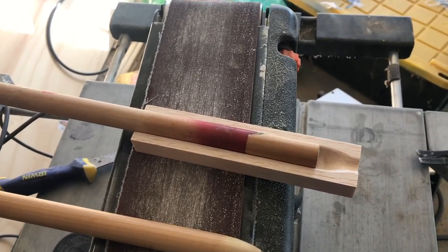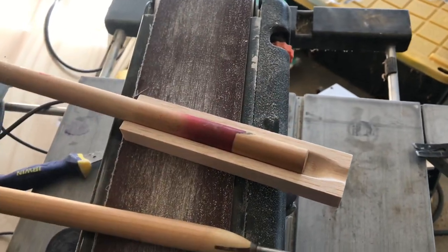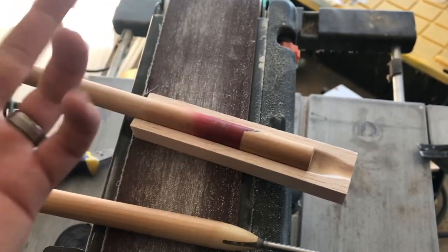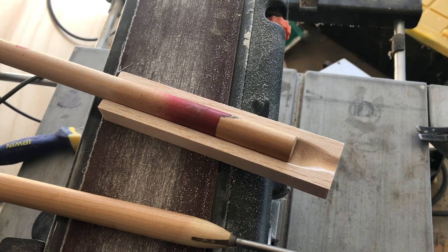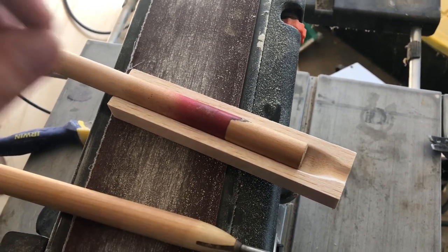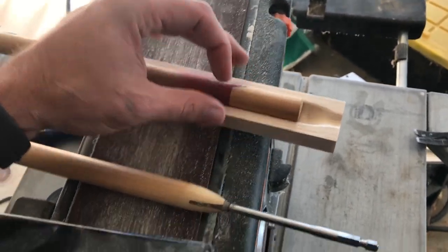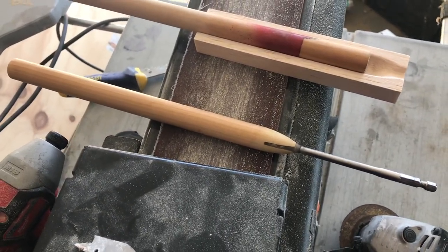I bought one dowel for the inside diameter and one for the nose diameter, drilled a center hole in the end of one dowel, put the smaller dowel in it, and glued it up. That first version was very basic and simple. But last year while we were shaping a rocket, the smaller dowel broke on me from repeatedly chucking it up in my drill. It's wood — it's not meant to perform that way. So this year I decided to re-engineer it. This is our space derby shaper 2.0.